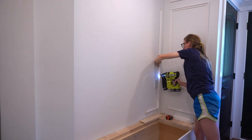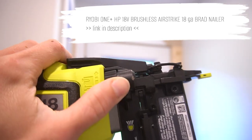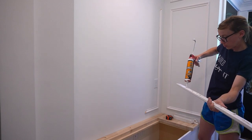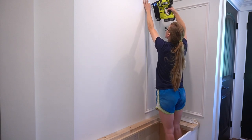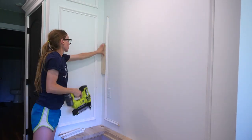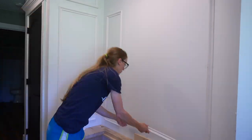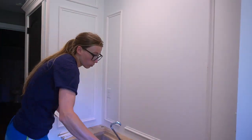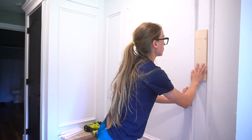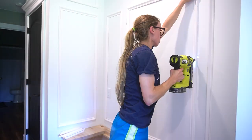This Ryobi OnePlus HP Brushless 18-gauge Brad Nailer is a great option for this as it's capable of shooting the shorter nails I need, and it has a depth adjustment setting so I can make sure my nail shoots just right below the trim surface — that way it won't go through the drywall, and it also makes puttying over the holes easier. I've been using the older version of the 18-gauge Airstrike for several years and loved it. The new HP Brushless version has a much quicker response time, delivers 60% more power, and has a nose designed to be much easier to see where the nail will hit so your placement is a lot more accurate. I'll leave a link to it in the description below.